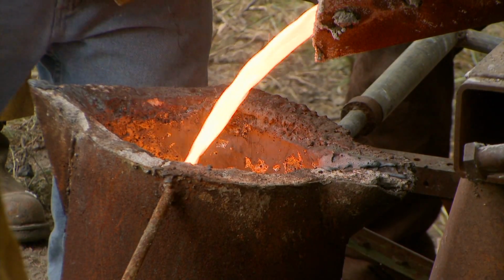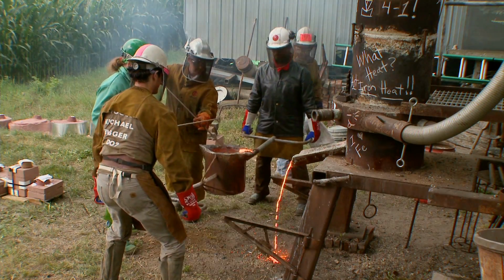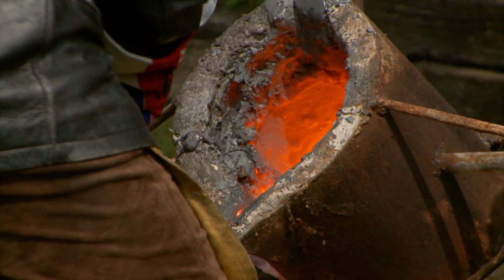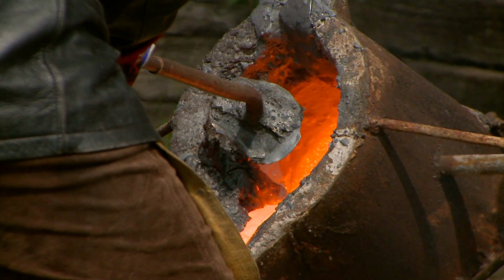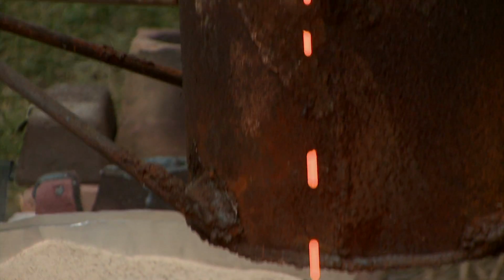Handling the ladle, you've got to be strong enough to carry anywhere from 100 to 150 pounds of metal. And there's this top part that's still molten, that's glowing at you, so you have a face shield. You have your helmet on for sparks and embers that are coming out of the furnace. You've got heavy boots on. You've got aprons or leggings. You've got your welding jackets, or what we call the baked potato jackets, which are the aluminum reflective gear.